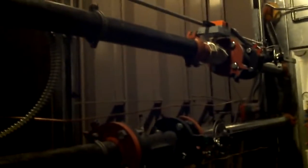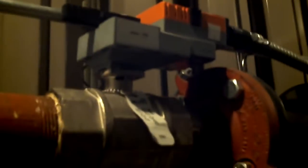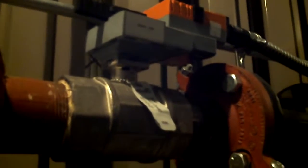Over in this chamber are the five face and bypass dampers. It's kind of dark in here, but you can see all the pipe work for the hot water system. We've got a hot water valve right there that regulates the hot water into and out of the hot water coils, which are enclosed by face and bypass dampers. Those open based on an actuator. So when we want to heat the discharge air, we have to open that damper and that hot water valve.